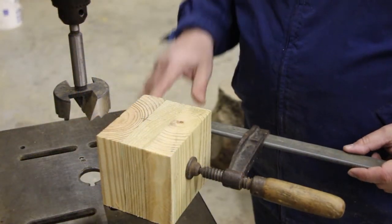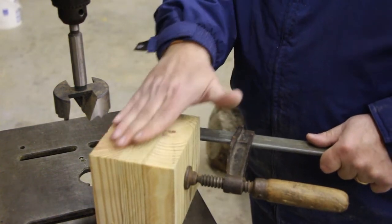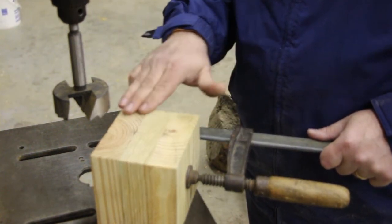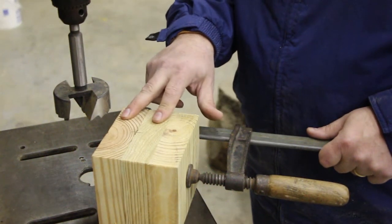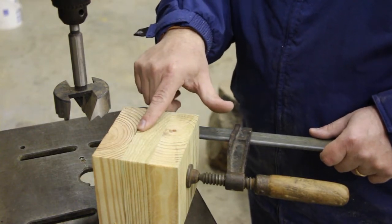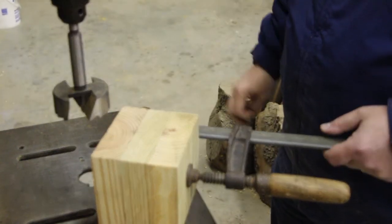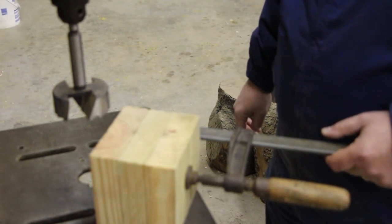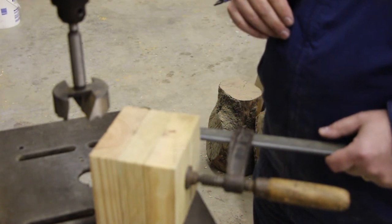We're ready now to drill this hole. I took a sacrificial piece of wood cut the same size as the block — these two pieces are what I'm working with. Because the center of the drill bit is going to be right on this part line, I took another piece of wood and clamped it on to give me a little more wood so I could get the center exactly on there. I've got the drill press set up with a three-inch diameter Forstner bit, which is the same diameter we need. I know we need to go three and seven eighths inches deep, so I've set up my depth stop on the drill press to go that deep as well.